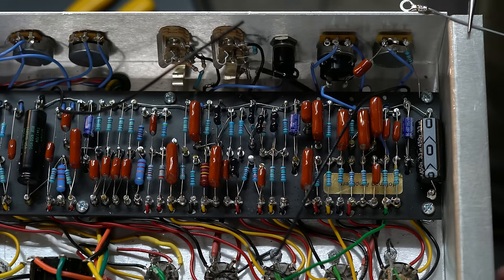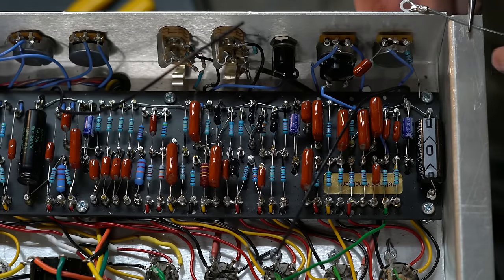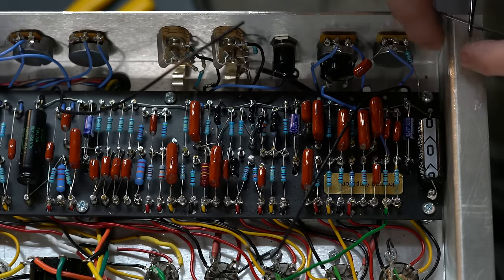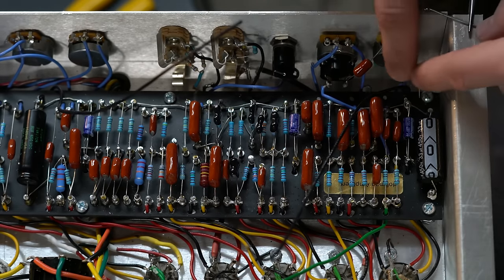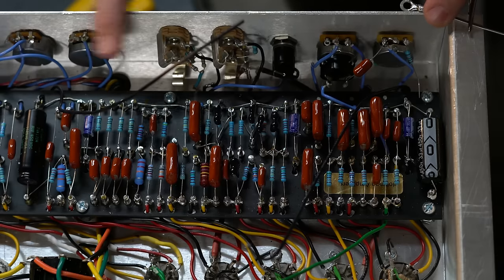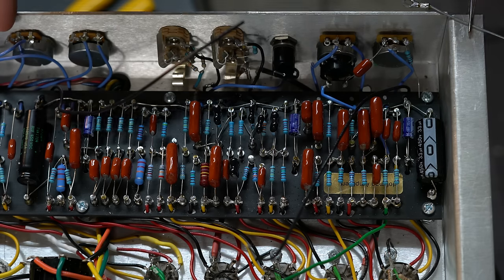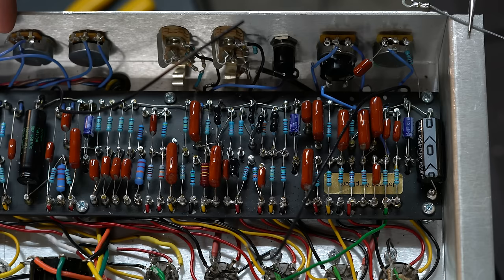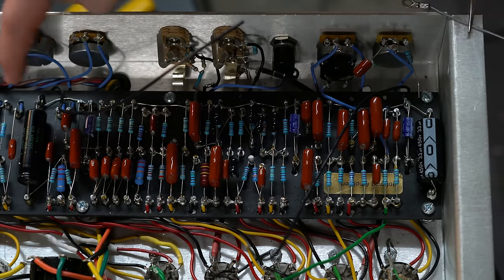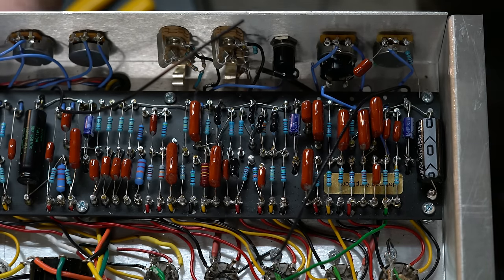That's going to be my anchor point. I drilled a couple of holes in the chassis down under here. I'm going to put this bolt down through the furthest one over and bring it up at an angle so I can wrap this resistor around it, then bring it back across here so I can anchor any of the grounds that need to go across that as well. My ground will need to go all the way down and stop at this last volume pot just at the edge of the screen. I'll hook it in there so it comes down and around and anchors into that.